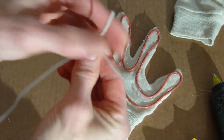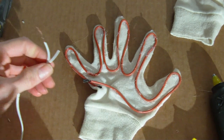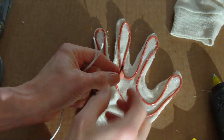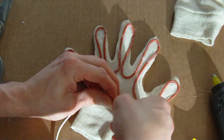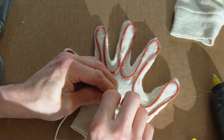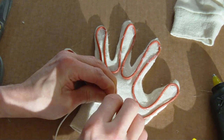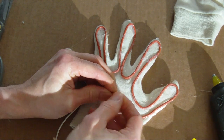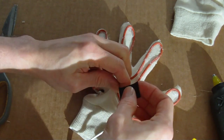Now all we got to do is take our wires. To connect from the wire to the carbon fiber, it would be better to put a crimp end designed for the carbon fiber because we don't want any arcing. Carbon burns really, really hot. Just want to make a nice tight connection of the copper over top of carbon fiber, so we get a nice twist on it. You cannot solder it because you'll never be able to solder to the carbon. That's pretty good, that's not going to go anywhere. A piece of electrical tape, put it around our connection.